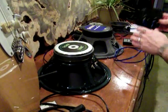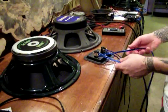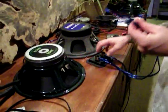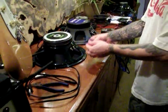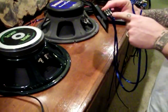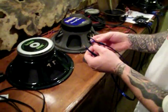In brief, if you're just trying to hook up some speakers in a cabinet, parallel wiring is exactly that. If you look up the word parallel in the dictionary, it's just two sets of speaker leads running in parallel with each other from the speakers to the input jack. You match your positive tab with your positive wire and your negative tab with your negative wire for both speaker leads, and you have them come together in parallel at the input jack, which in parallel will cut your ohm load in half.